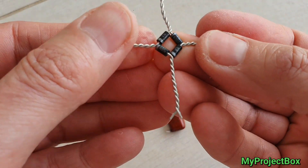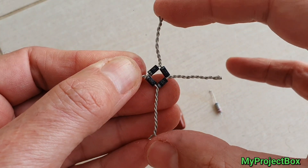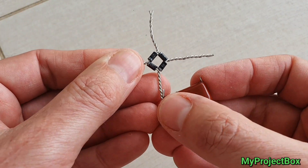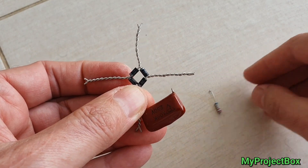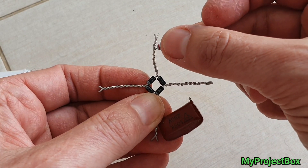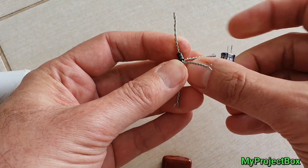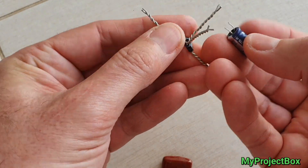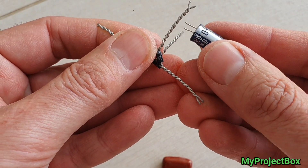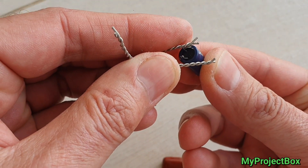This will be the positive out, this will be the negative out, and these two terminals will be our AC in. So the capacitor — one side goes on the AC in. We can put our fusible resistor on this side, or in line with the capacitor — it doesn't really matter. Then the output of the bridge rectifier just connects to the capacitor. Bear in mind we need to know which one is positive — the one with the stripes is the negative, so the other would be positive.